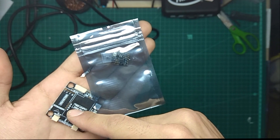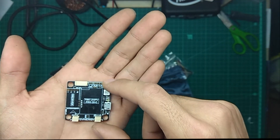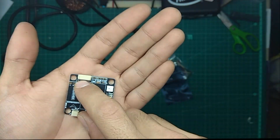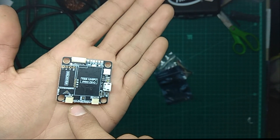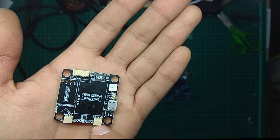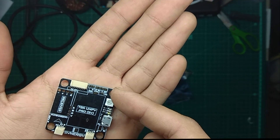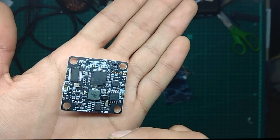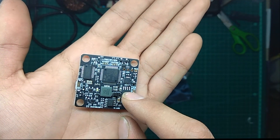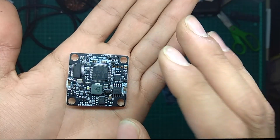You can also mount the Unify Nano here, which is really small. If you buy the TBS Unify Nano you get a PCB and you can easily mount it on this board. On the other side you get your USB port and ESC cable ports. There are also two 5V DC output ports for LEDs or whatever you want, plus other voltage ports. On this side you've got your OSD chip, STM F4 processor, MPU-6000 gyro, and 5V regulator.